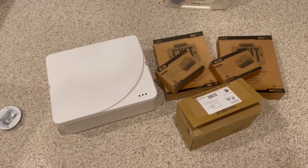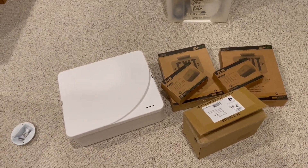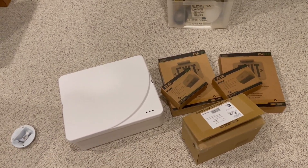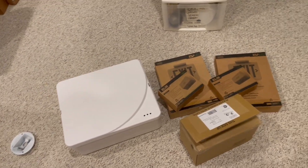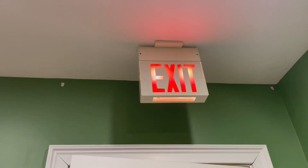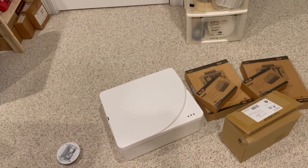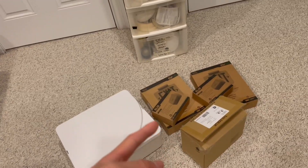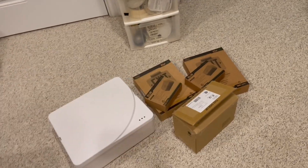I have these right here. This is the Dual Light ELSS system. These are basically a little different from standard units. It's a central battery pack that runs a bunch of remote units. So unlike standard units where 120 volts runs in and powers each one separately, none of these have batteries. The battery is contained in one box and these are just extensions — you can think of it like a fire alarm system where there's just a panel and then a bunch of field devices.